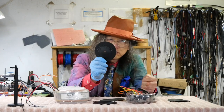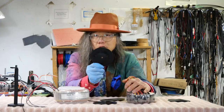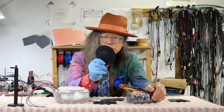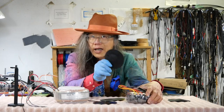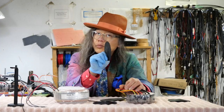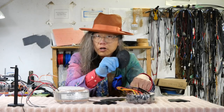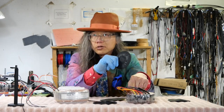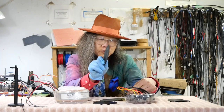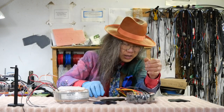Let's call it cushioning rather than insulation. That thin washer will eventually wear out. The insulation between the wire of the transformer and the metal chassis is the rubber washer — that's the only thing I rely on. The mylar is also insulation, the enamel coating is also insulation, even the paint on the metal is insulation, but those are not reliable insulation. The rubber washer is the only reliable insulation. If you cut through it, the rest are just not reliable.